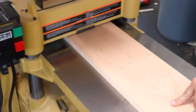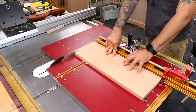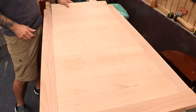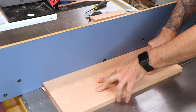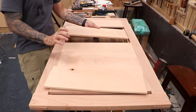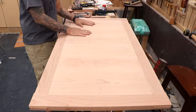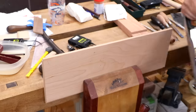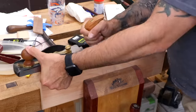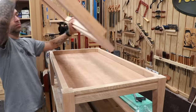For the top, I'm going to cut individual boards. They'll be cut for a snug fit along the grain, but from side to side we'll need to experiment a bit for a perfect fit. When you butt them up side by side, they should hang over quite a bit on the frame. At the table saw, I'll cut rabbets in the edges to create shiplap joints. Back at the table we can do a test fit — if it's too tight, we can cut the boards down slightly and then recut the rabbets. Once they're nice and snug, I'll take a few passes with my jack plane on each rabbeted edge to provide enough slack for wood movement. Now we can glue the top in place — just a bead of glue on the filler strips will do the trick.